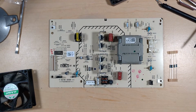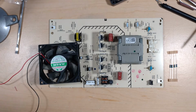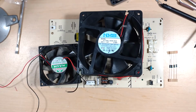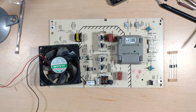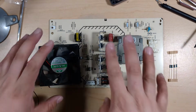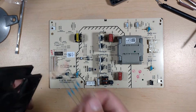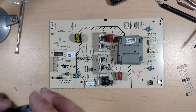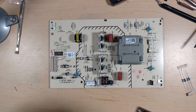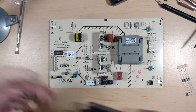I did find, if I want to run a fan at half voltage to make it quiet, a tiny bit bigger 24 volt fan kicking around. I'll find a use for this thing someday. But yeah, I'm going to just hook these 4 resistors up in parallel to basically make a 1 watt resistor, which is what I would need, roughly, probably a little lower. And then that's basically just going to be a perfect length of cable, as it is.